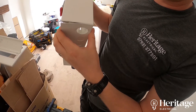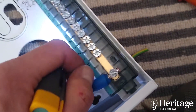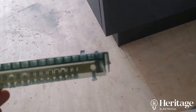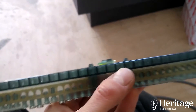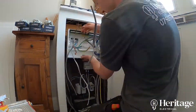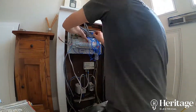So we're going to have to take that board back and exchange it for a new one. In future, if we use this manufacturer again, instead of knocking out the knockouts we will use a hole saw and drill those out just to be a little bit more gentle. Now, another problem I came across on the replacement board was that the plastic housing which contains the neutral bar and the earth bar was loose in the metal enclosure. There are a couple of ears that click into the metal part of the board, plus three or four plastic tags on the back which locate in the metal board. One of those appeared to be oversized, so I had to use some snips or a Stanley knife to shave a bit of plastic off, and then the plastic housing located in the metal board. But it just added a few minutes onto the installation time — a little bit of inconvenience, worth pointing out.